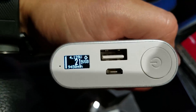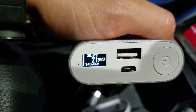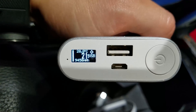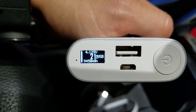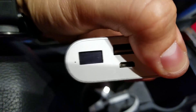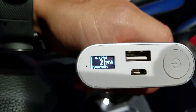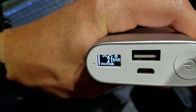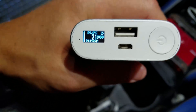There is the finished product. I originally started this just thinking it would be a novelty, but I've actually found it to be incredibly useful — for example, I discovered that my phone charges quite a bit faster with the screen turned off, which I never would have known from just the standard power bank. Having a live readout of the current has proven remarkably useful, and I also feel better about estimating remaining charge when I can see an actual milliamp-hour count instead of just four LEDs.